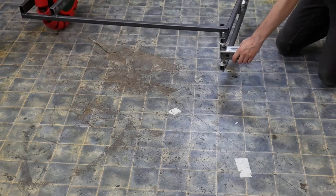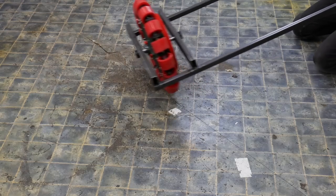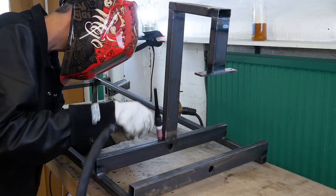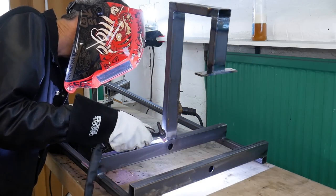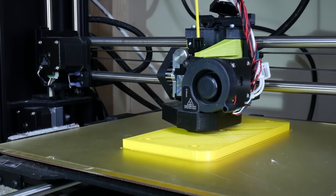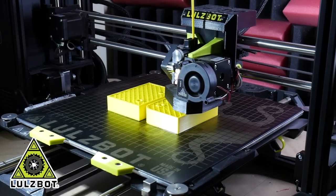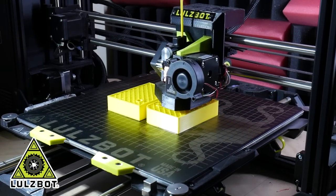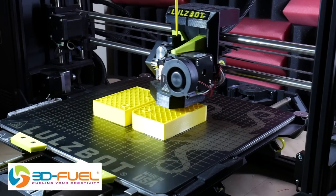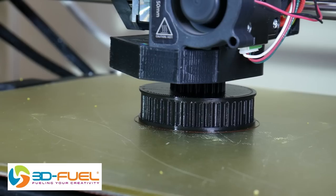My Omni wheel is mounted on a piece of bright steel bar which is pretty well toleranced for the bearings already on the wheel, and I've got a collar clamp on each end to stop it falling out. We just need to weld on a quick bracket so we can attach a gearbox — a really similar setup to lots of projects I've built recently. This style of belt reduction gearbox has both 3D printed parts and CNC aluminium parts. Thanks to Lulzbot for supporting my channel with 3D printers, and thanks to 3D Fuel for the filament for this project.